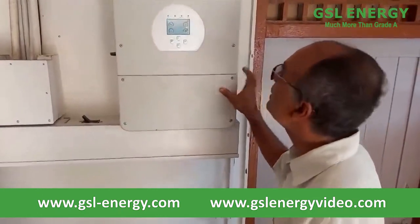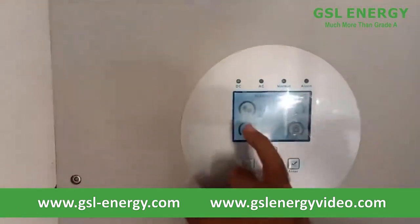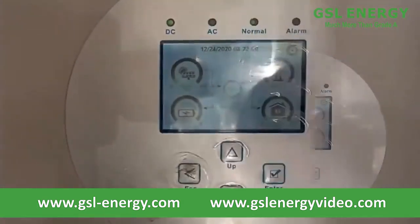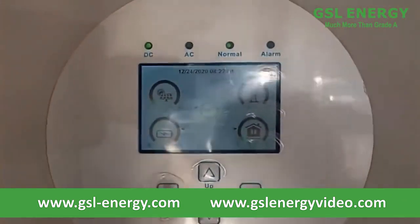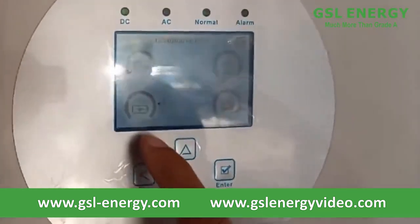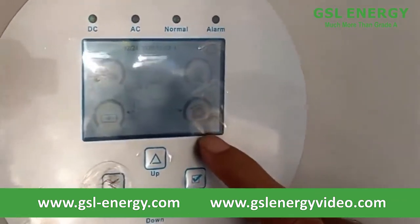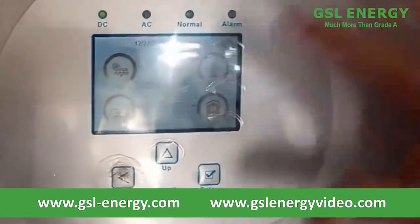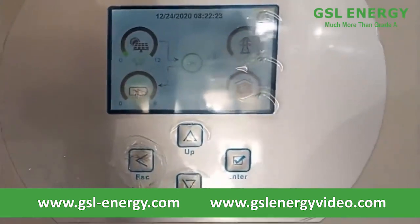Now, just a quick overview. For example, right now I'm producing about 0.8, 0.9 kilowatt of power. This power goes up and down. At some points you'll see it going up. We're having a shadowing situation right now. This is the battery. The battery is 99% charged and it has 0.4 going to it. My consumption on the building is 0.82 kilowatt. This is early in the morning, and this is the grid. So everything is being shown here.